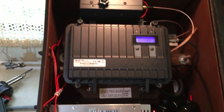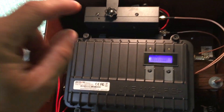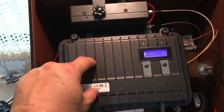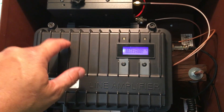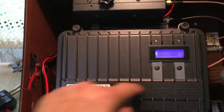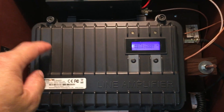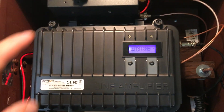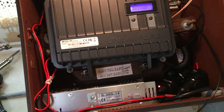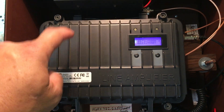Just remember — turn down your repeater using the software. There's a low and a high setting. Put it on low if you're going to run an amplifier, otherwise you're going to burn it up — it cannot handle the power coming out directly from the repeater itself before the duplexer. Now just because mine does about 6 watts doesn't mean yours will be exactly the same. You should always double check it — measure the power before the duplexer.